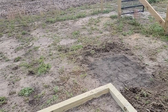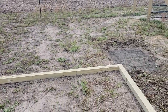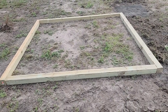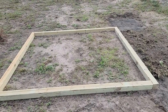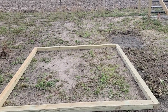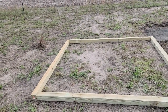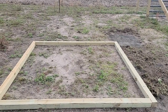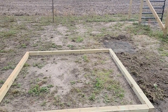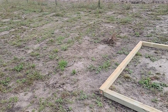My goal is either Friday or Saturday at the latest, I want to start framing the coop. This is going to be the low side over here, so that's the side I'm going to start with, and obviously this is the high side. I want to make sure I can cut and get those walls framed up and pseudo-stable so I can start framing the rest of it. If I can get these two sides up, I can infill with the other two sides, and once some of it starts getting attached it should sustain itself. I might need bracing until I get to that point — that'll be a judgment call.